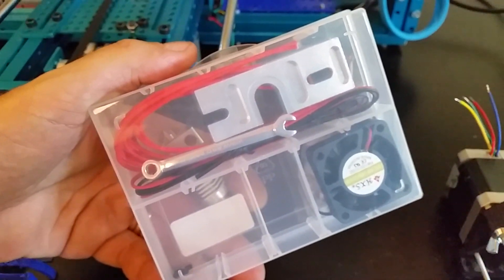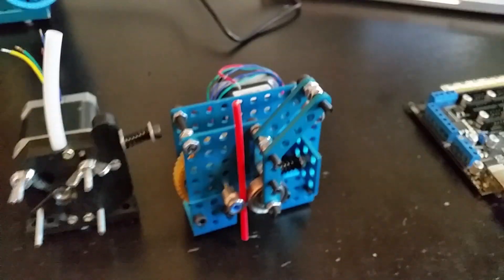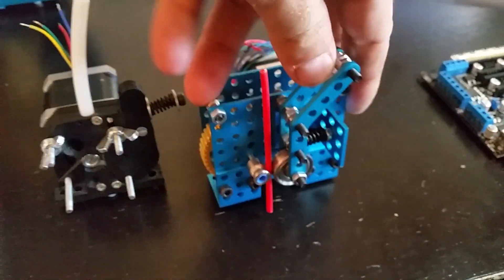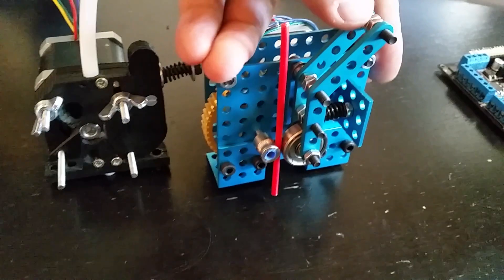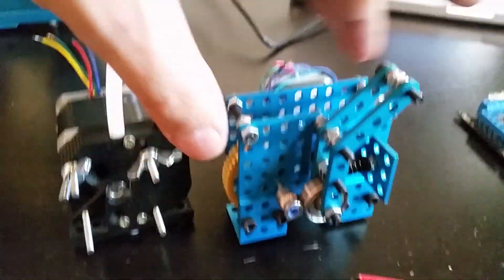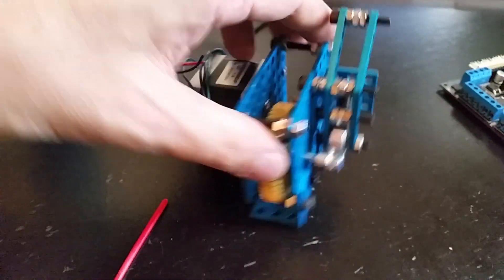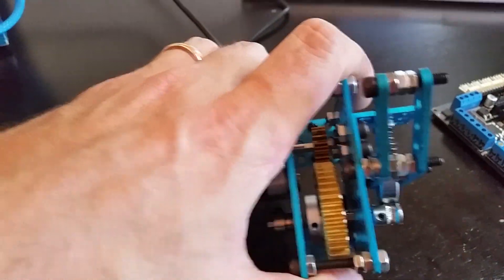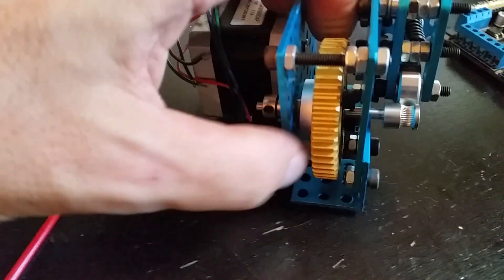It's a full kit with all the gear required, like a small wrench, a hex key, and everything. And just for fun, here's a MakeBlock-based extruder using the MK8 pinch wheel. It's really hard to open up — everything is here; the only thing missing is the guide that guides the filament down through. You can see the gear — it's a 62-tooth gear driven by an 18-tooth gear, I think. These are the beta gears I was given from MakeBlock.